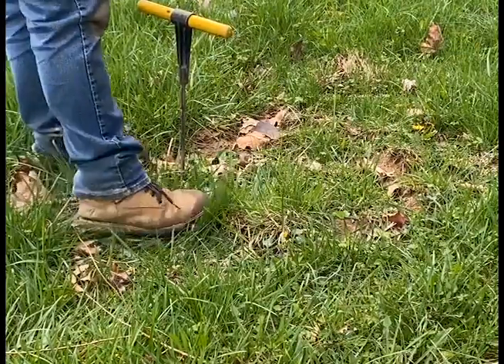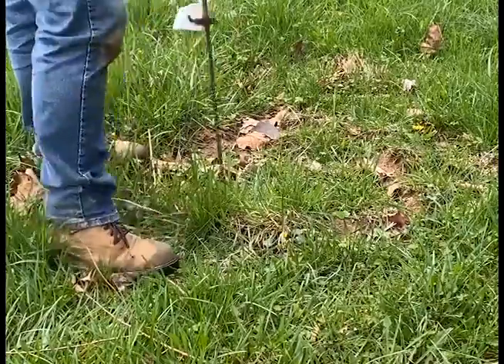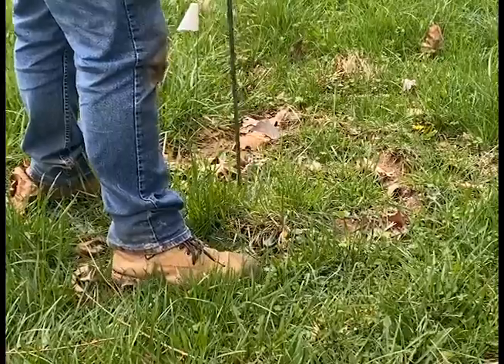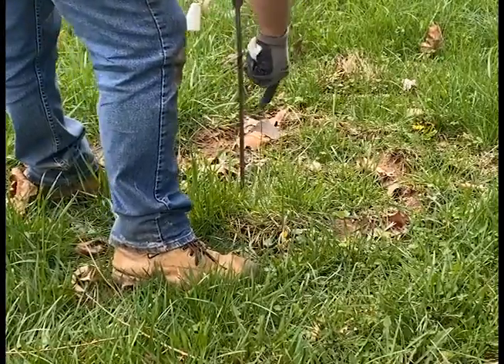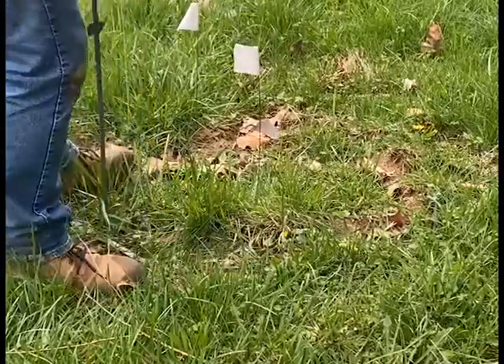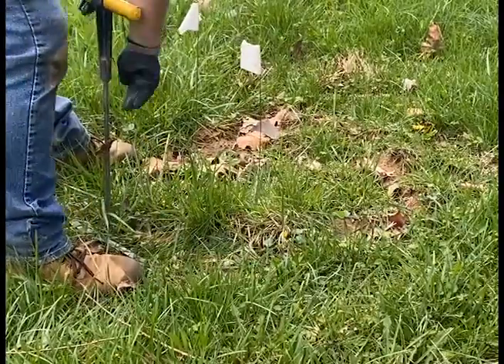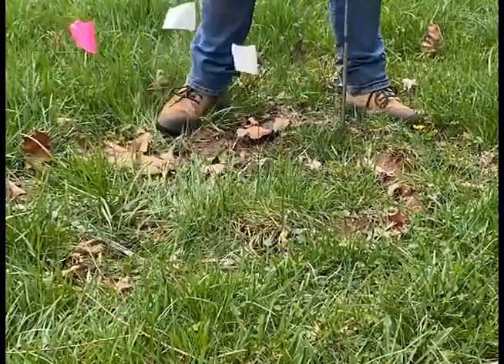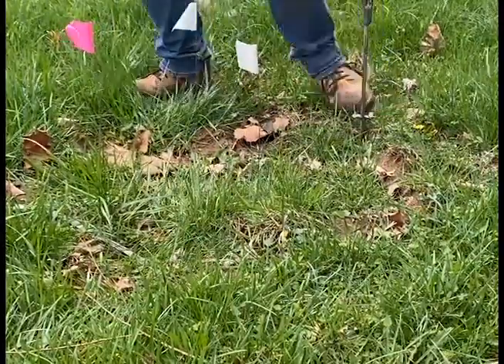As you can see right here, what I'm doing is I'm marking out all of the edges of the box. The reason I want to do that is so that I know where to dig. That probe that you see right there in my hand, that's what we refer to as a T-probe from TNT Tools. I will go ahead and link their website below, but this thing is actually insulated so that if I probe through an electric wire or whatever, I'm good to go.